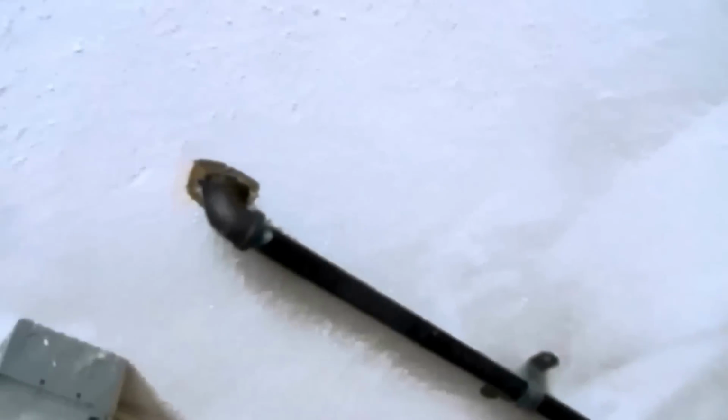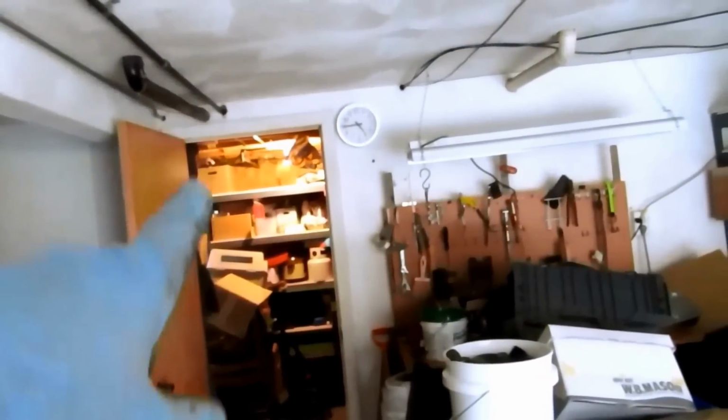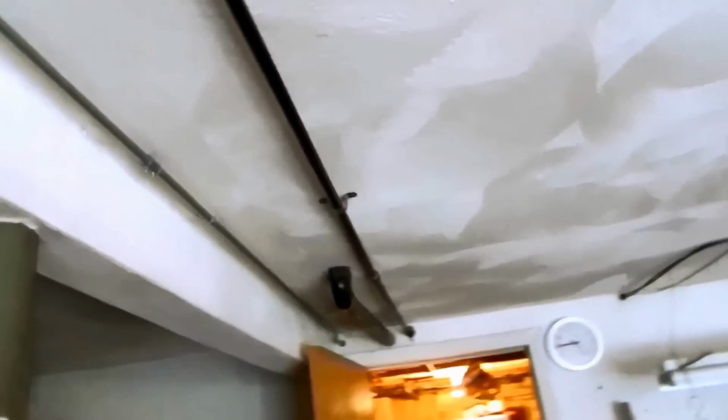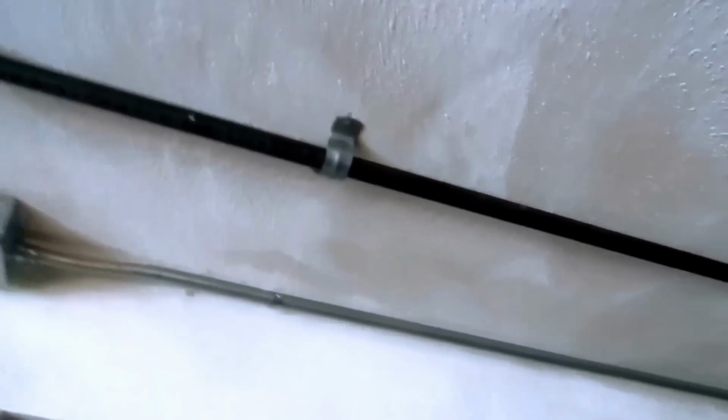Guys, I got a couple of hangers here. I wanted to keep it up tight. In my state, we can't put a drip in any cold area. So I'll put the drip down inside that area over there where it's heated. I've got a couple of hangers here. I just used a couple of 1-inch galvanized clips. Hold it up and be nice.